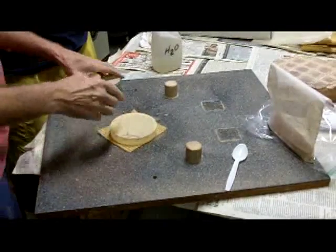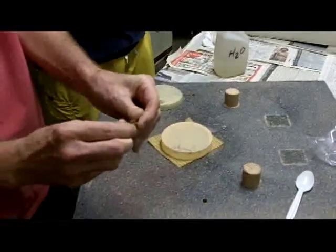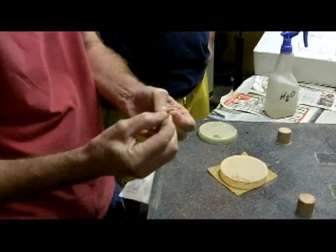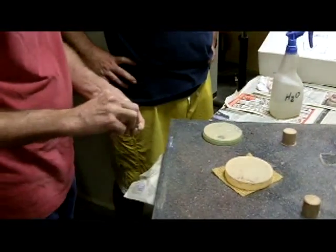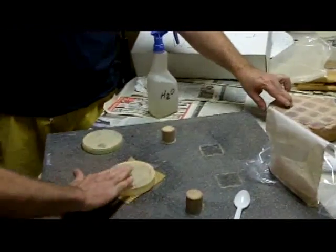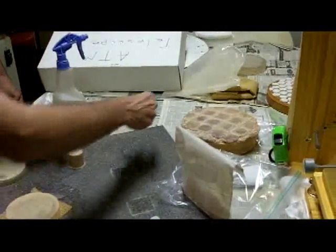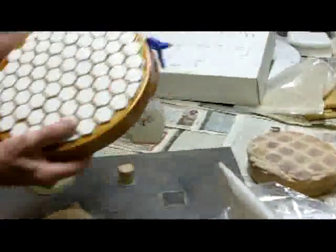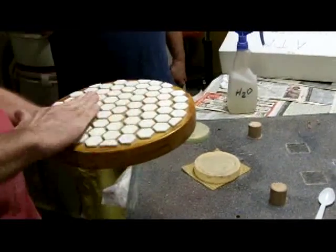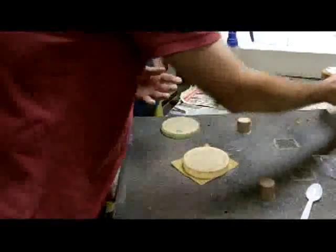But instead of a hard surface like this, which on this one breaks them off, this is pitch, and it's fresh, it has a lot of give to it, and it doesn't break as much as what that did. And because of the give, the cerium oxide bonds into the surface. Whereas with the tool, when you had grit on the tool, it rolls on the surface. And the grit is rolling back and forth and grinding away the tool and grinding away the mirror.